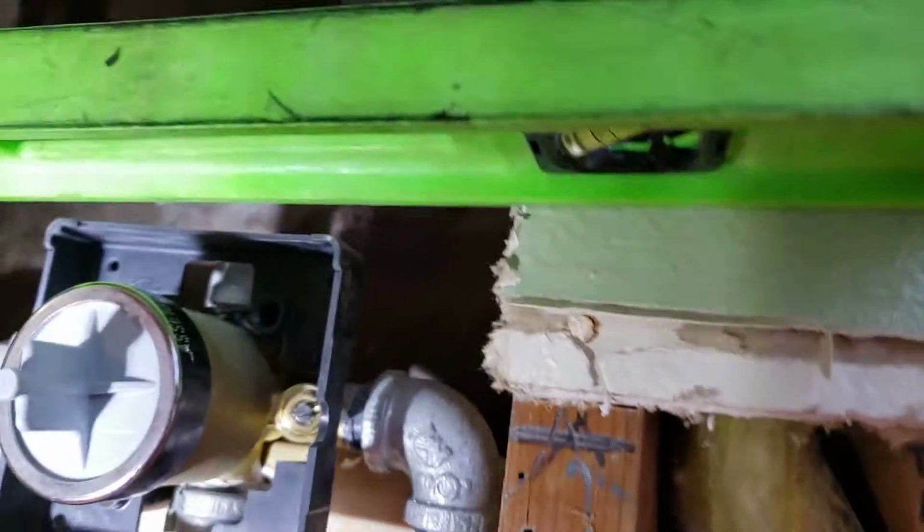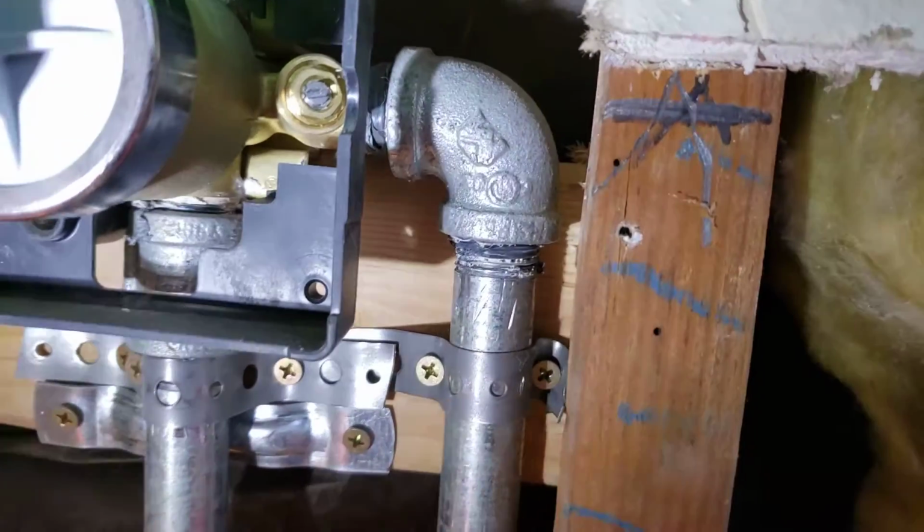So that's good. Over here, you've got the same thing. Slide it across here. Same thing, slide it down. Yep. So this is finished wall, 1/2-inch sheetrock. They weren't doing anything over here. They may change that, so homeowners let us know they might want to do tile on this wall, which is fine. If you do, we'll need to come back and get this valve moved out.